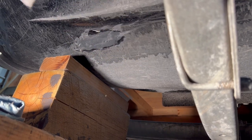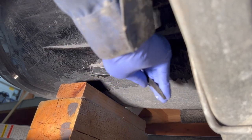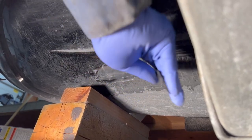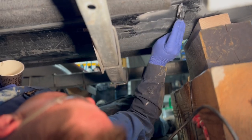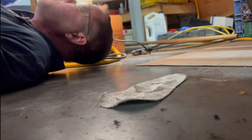We're going to be sanding this out later, so you don't have to be really careful. When you wet it out with your paintbrush, you just want the glass to wet — you want the glass, not the fill. Get it all in and get all the air bubbles out. Let me wet this out with the paintbrush — it's just going to sink right in.